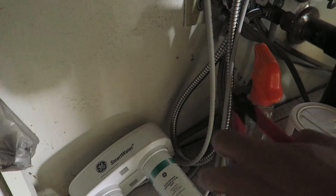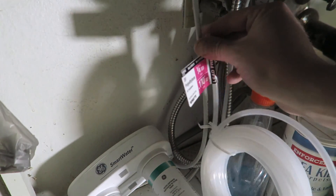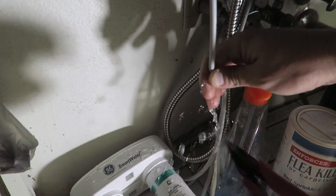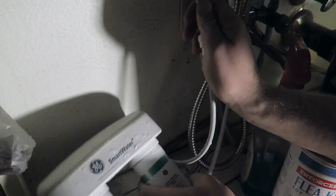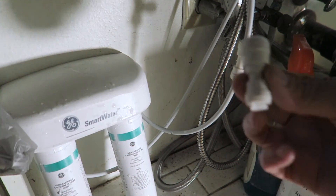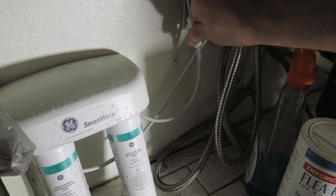Water's off, let me clear the line. This goes up to the filtered end so I'm just gonna cut it. It's quarter inch. I've got one of these T-connectors — I'm going to attempt to tee it off here. It's a forever bond. Now I've got a teed-off line — this is super jankopotamus, I'll tell you that upfront. I'm going to use this barrel connector, so now I've got a barrel connector on quarter-inch, and this will accept three-eighths inch, which is what I want to get up to.